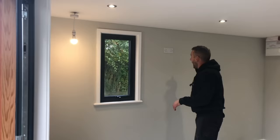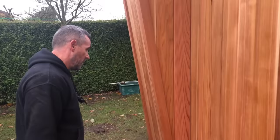The roof, it's a one piece rubber roof membrane. We've fit anthracite fascia. We've fit a cedar soffit, it's Western red cedar and it's treated with a UV stabiliser. I showed you how to build these dummy pillars. They really make the building look well. We've put on these corners as well, which finish it off nice.